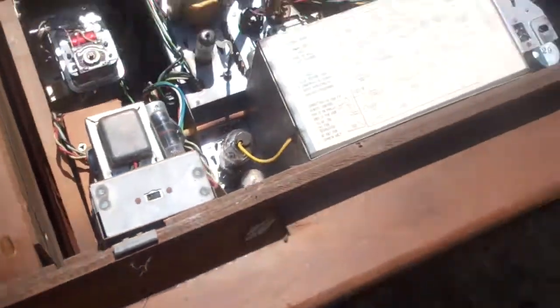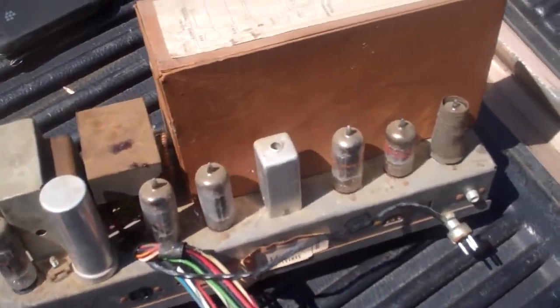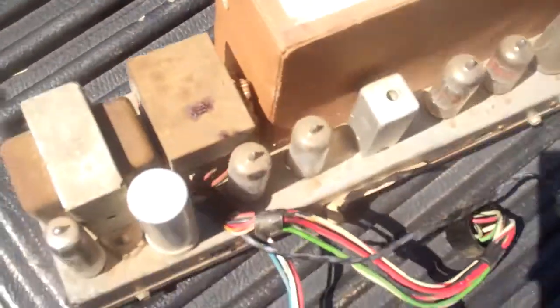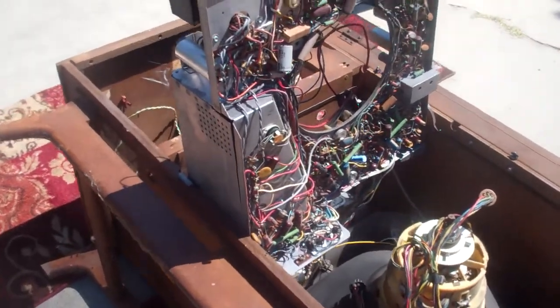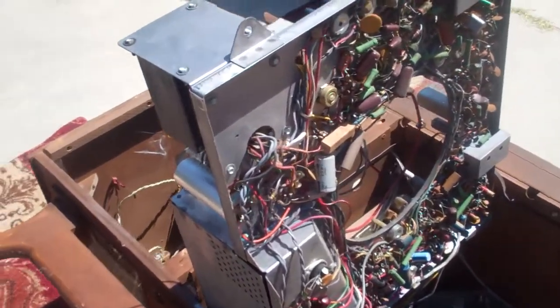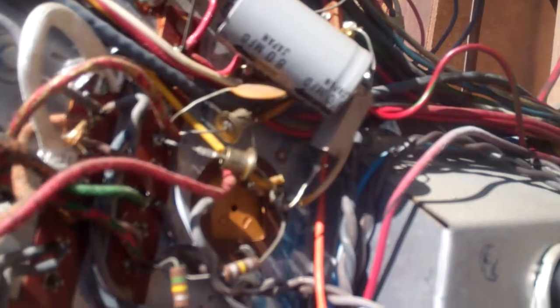This is really complicated at this point. Look at that — a vacuum tube remote control amp. This is essentially the same chassis as that set I gave to Chris W71 that had the bad flyback. You can see someone's done some work in here — probably the doubler went open, so they just stuck an 80 at 450 in there, and you can see several of these power resistors have been replaced.